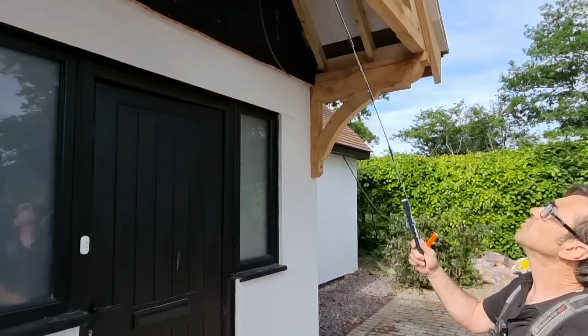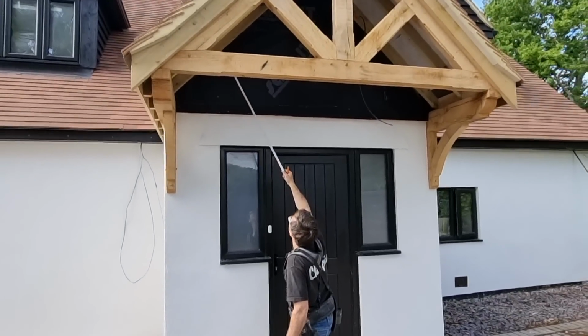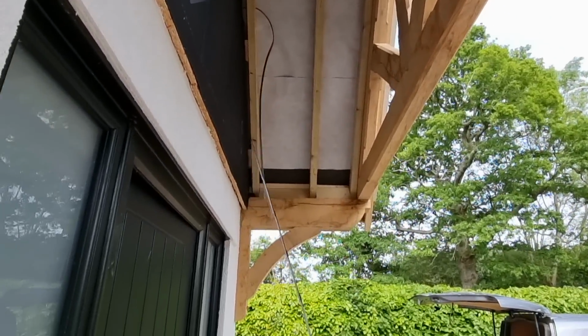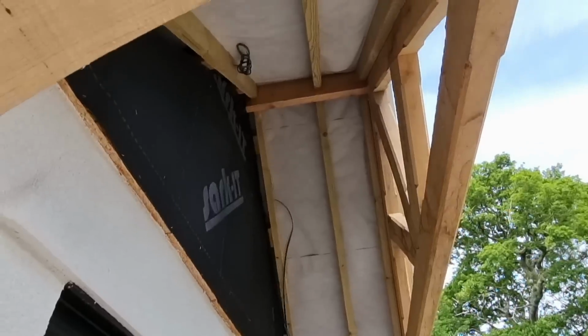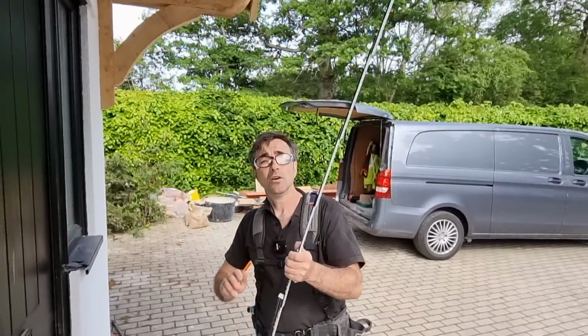So we've got a gable here that we've made, a lovely oak gable, and we're going to be using Thermo Wood all the way up these rafters from ridge to plate. This is a very simple job, each one butts against our oak frame here at the back and comes across to here. So it butts against the OSB gable there. So we can cut all those just a hair underneath, all ready done.